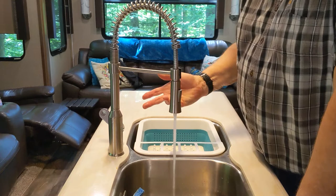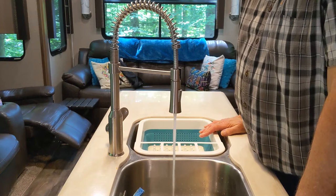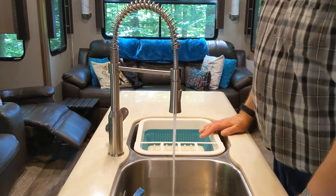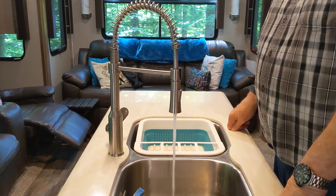The cold side looks pretty good — we didn't open the cold side but it's a good idea to run both. Run the hot a little more. The shower is at a higher point than the kitchen sink, so there could be air collected up there in the shower hose where water might still be spitting. Let me go do that and we'll close this off for now.